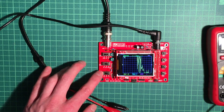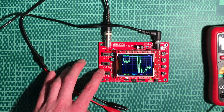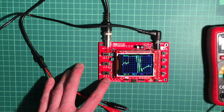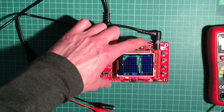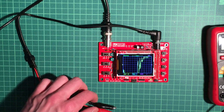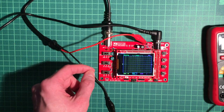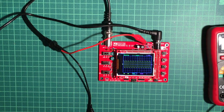And there's two sensitivity switches, one for the millivolts, 10 millivolts, 100 millivolts and 1 volt, which is then the scale of this vertical axis, and also some scaling factor 1, 2 or 5. For testing purposes there's a little loop soldered onto the board which gives you a rectangle wave of 1 kilohertz. You just attach the red clip to this and you see that it's working, but it looks a bit weird, so we go to the 1 volt setting and that's much nicer.